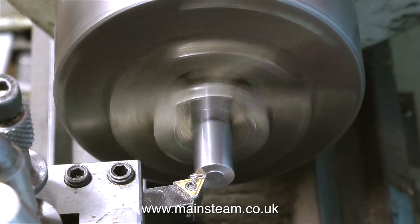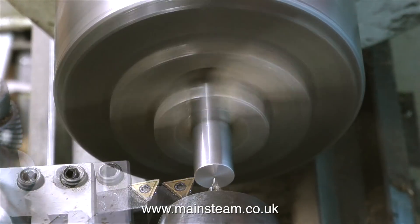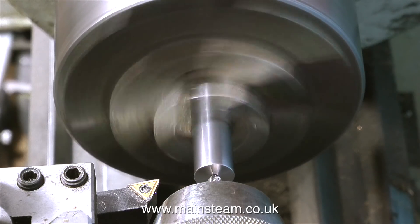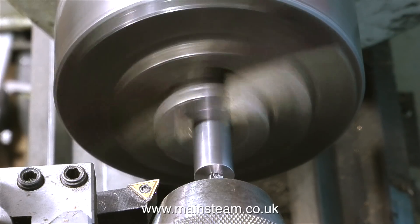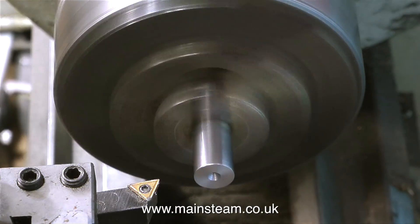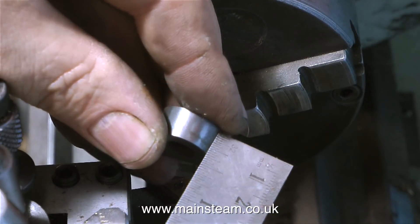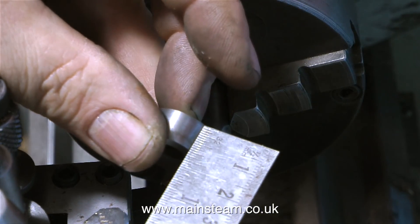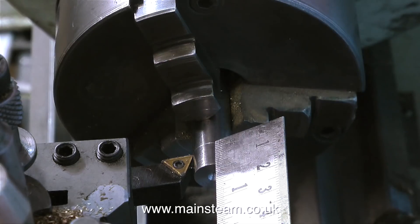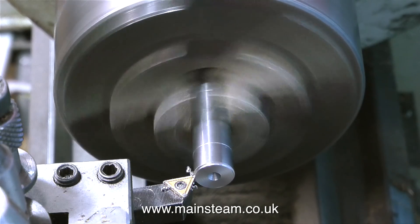A good tip is to use a new tip on the carbide-tipped cutting tool — the idea is to use a nice sharp cutting tool so you get a good finish. First of all, as usual, I always face across the end of the work, followed by a centre drill. Why am I centre drilling the end? No real reason, because I'm not going to use anything to put in this centre. But if you look at most steam engines on an axle or a crankshaft, you will see a large centre in the end of them, because they will have been turned at some stage between centres. I'm not going to do that, but for effect I need to have the centre in position. Just to confirm the thickness of the crank web — it's three-eighths of an inch, so I need to turn down three-eighths of an inch of the end of this piece of bar. I've marked the position of three-eighths of an inch down from the end of the shaft and I'm just making a mark with the tool, so now I have a line up to which I'm going to cut.